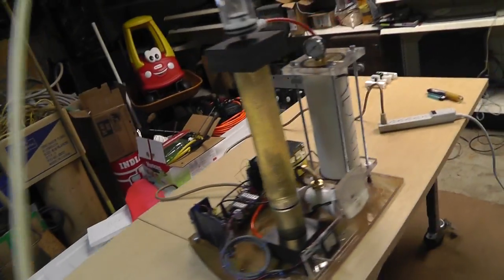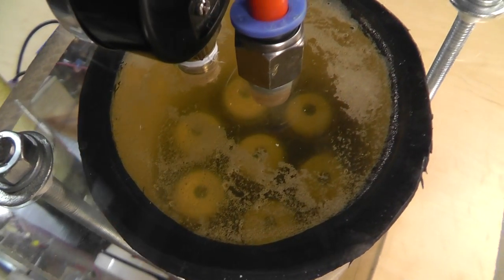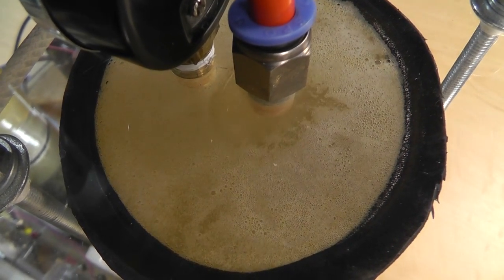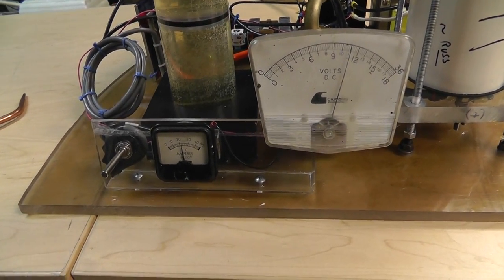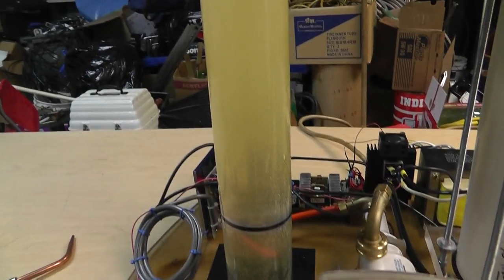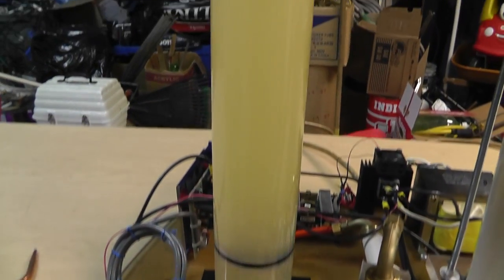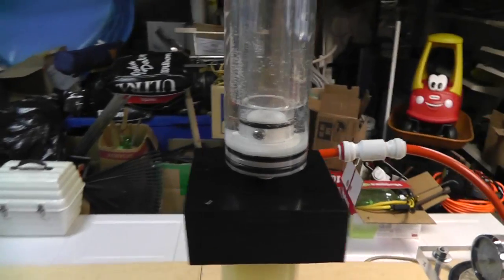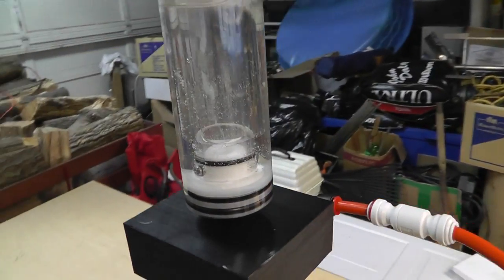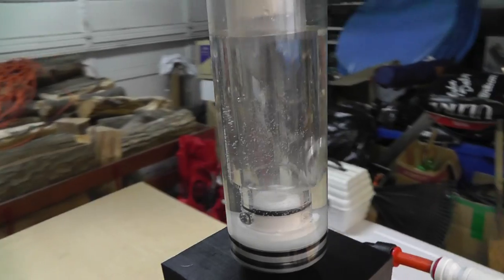Let's turn on the gas. I'll just turn it all the way up. There's your gas production - we're at 11 volts, 21 amps. There's your tube full already. I'll go ahead and turn it back off, you can see it drops back down. Let's do some burn testing. Those are some giant bubbles coming off that thing. I really don't know the production rate - I'm going to let this vent out and get through this entire tube, it'll take a couple minutes and then we'll get back on track.